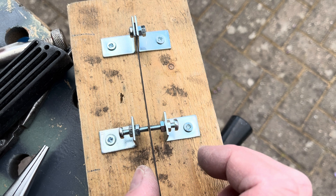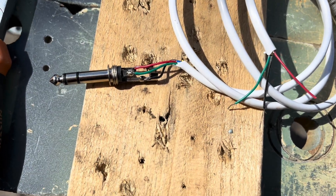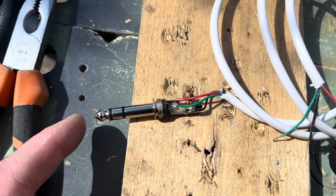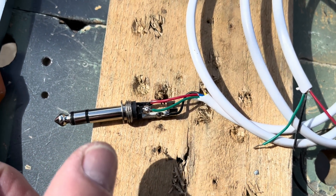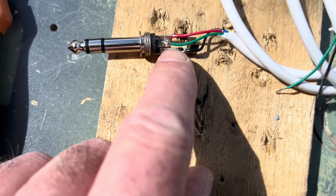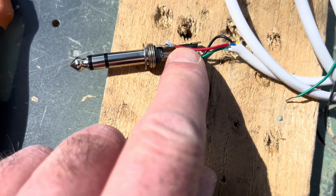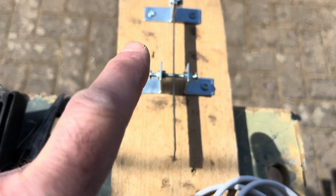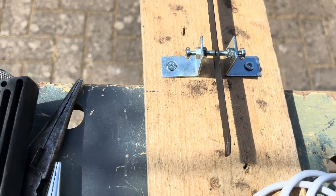This needs to be a bit shorter. I'll figure out something on the end. We'll connect some wires up and see how it works on the rig - this is about as simple as it gets. I couldn't find any scrap three-core wire for this test so I've just used six-core alarm wire. The standard on keyers and probably rigs as well: tip is dits, ring is dahs, sleeve is common. On a paddle key the right-hand side is dahs and the left-hand side is dits - so right-hand side green, and the tip is green.